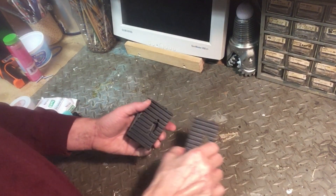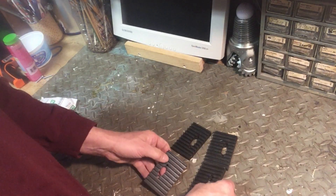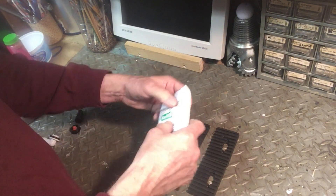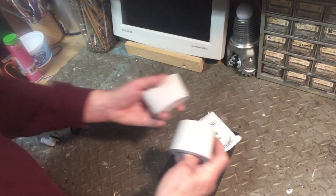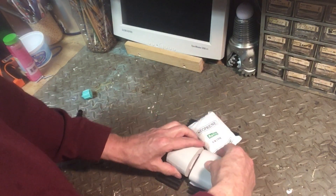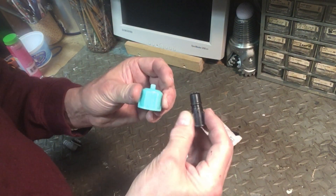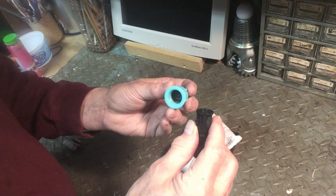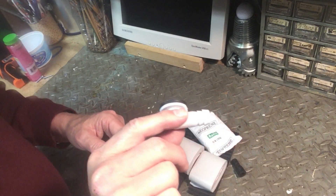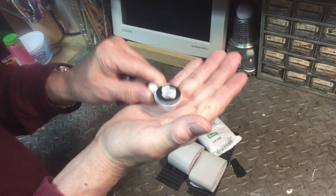Here are some accessories that came with my unit. There are four rubber pads for mounting under the outside unit — these might be handy if you mount it on a rack on the wall, but they weren't necessary to mount it on the ground. There's a bag of goop for sealing; I didn't use it — I just used some old closed cell foam rubber in case I had to disassemble anything. There's some non-sticky tape used to wrap the line set; I didn't use it except right at the unit because my line was completely encased in foam insulation. There are covers sealing the line set — the line set is charged with nitrogen to keep it from corroding before you receive it; if you don't hear nitrogen hissing out when you carefully remove these, you know the line set has leaked. Finally, there's a drain valve that's supposed to screw into the bottom of the outside unit, but it was too big to fit between the plastic base and the machine. It might come in handy if you are mounting your unit on the side of the house and want to direct the condensate away from the house.